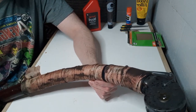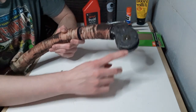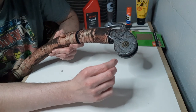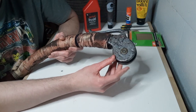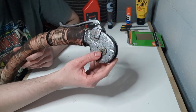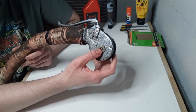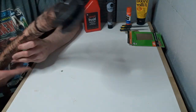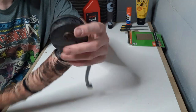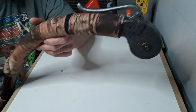Once I get better at 3D modeling on Meshmixer, I will probably add a pin through the blade itself, so I can just remove that when I'm ready to do anything. That way it'll keep it in a static position. And I actually made do with altering the nuts on here, the plastic pieces that you would screw the M3 nut into, by plastic welding a nut onto the inside of this, so I didn't have to buy another screw, because I'm still not sure if I'm going to be able to find an M3 30mm.